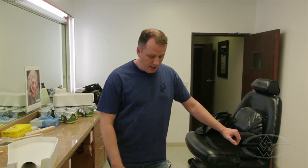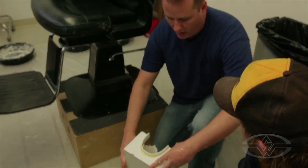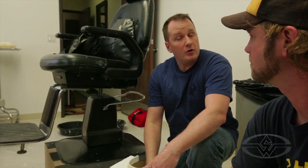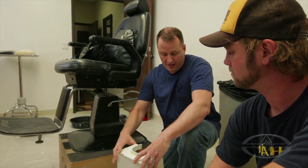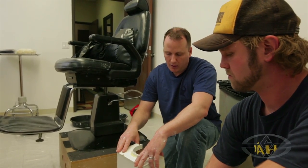This whole process will also be duplicated for the other hand — the right hand. One thing to be careful of is trapping air. Because of the orientation of the mold, when you pour the plaster in it can create air bubbles, and sometimes the tip of a finger won't fill or there'll be little surface bubbles on the positive. You can reduce that by putting the mold on a vibrating table. What we're going to do today is pour the plaster in, rock it around, pour it out, and then pour it back in — that'll help reduce the chances of air bubbles.